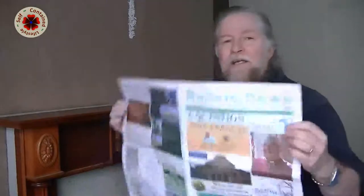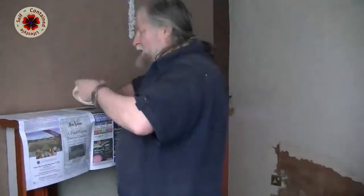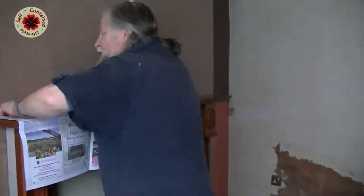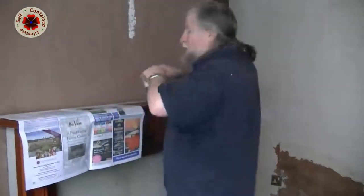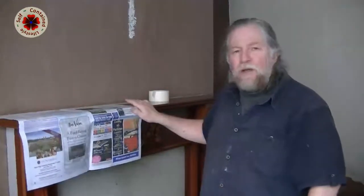We get some newspaper and cover the rest of the area. Once we've masked off the sharp edges we can put newspaper around, and we don't have to worry about cutting in sharp edges there, so we just tack the newspaper on wherever we want it stuck. I've now finished the masking — I've done the mantelpiece, fireplace, the light fitting, all the plugs, the vents, and I'm now ready to go.